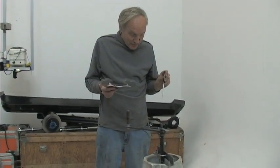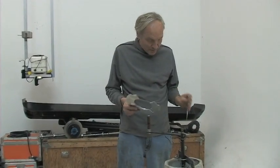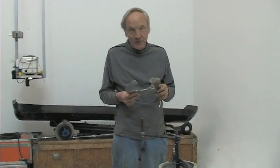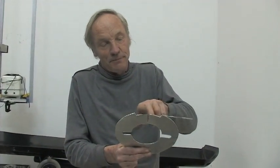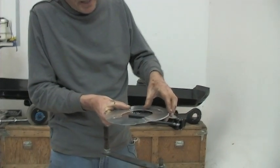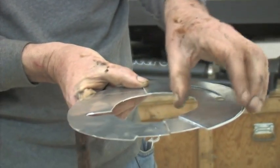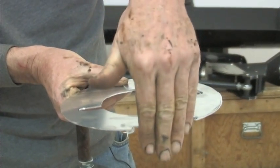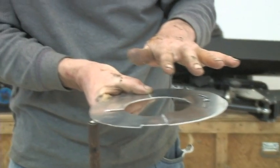The last thing is to put in the metering plates. If you put peanuts in right now without any metering plates, they'd fall down between the rotor and stator in such quantity that the rotor would jam up. So we make sure the peanuts dribble down through the small gap in the metering plate so they don't jam the rotor. We assemble the plate on top, then add another small plate that slides over the top to open or close the gap, allowing us to adjust exactly how fast the peanuts come in. We adjust for peanut size by raising or lowering the rotor, and adjust for peanut quantity by sliding this plate back and forward.